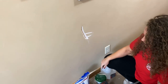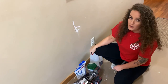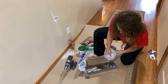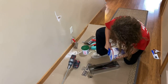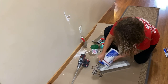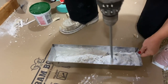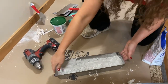Now I'm going to mix up my Easy Sand — this is the 5-minute, faster stuff. We're just going to pre-fill this first. We're not going to be putting any tape on it yet; we're just going to fill the holes. I'm going to pour my water in the pan first, then add my mud. I of course used too much water because that's how I always do it.